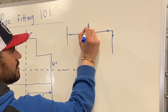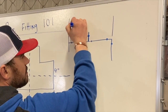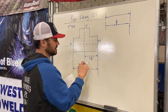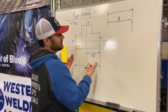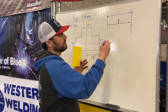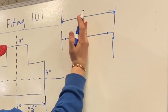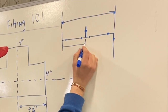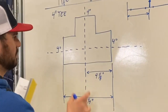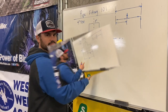When you're calculating this run of pipe from this center line to the face of this flange, and you went to take out for this T and looked in your blue book and it said four and an eighth — if you only take out four and an eighth, that's only half the T. That's why it's important that you know that when you're doing measurements where the T is in line. When you're figuring this pup from the center of the T to the face of the flange, that's when you take off for half the T, which would be four and an eighth. But in the long run, you need to take off for the whole T.